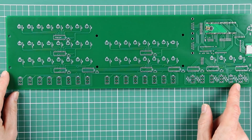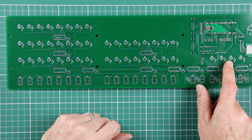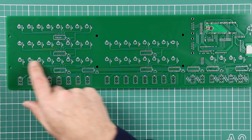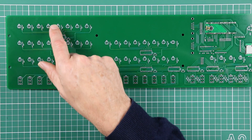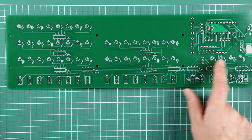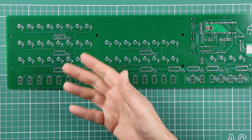On the front side of the circuit board we've got five sets of eight LEDs to insert, and then the balance of the four remaining run control LEDs on the right-hand side. I recommend systematically working through eight LEDs at a time from the lower left corner — get this set in first, labeled LA8 through LA15, then move up row by row, on to the two sets in the middle, and lastly the four on the right. After soldering in eight LEDs we'll put their accompanying resistors in and then test them to make sure they're working and oriented correctly.